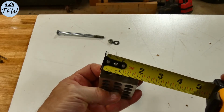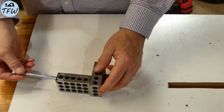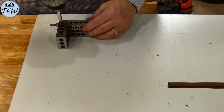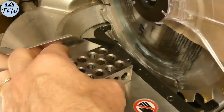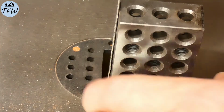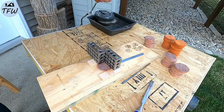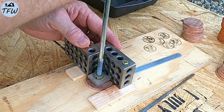And they're heavy, precision milled steel that was originally used in a lot of steel millwork, but they make great additions to the wood shop as well. You bolt a couple of these together and it forms a perfect 90-degree angle for a hold fast for certain projects. But because they're also perfectly cut at 90 degrees, you can check to make sure your saws, your band saws, your drill press are all calibrated appropriately before you start to work. They're great additions to the shop. I even use them to build little jigs here to help me with my branding iron.